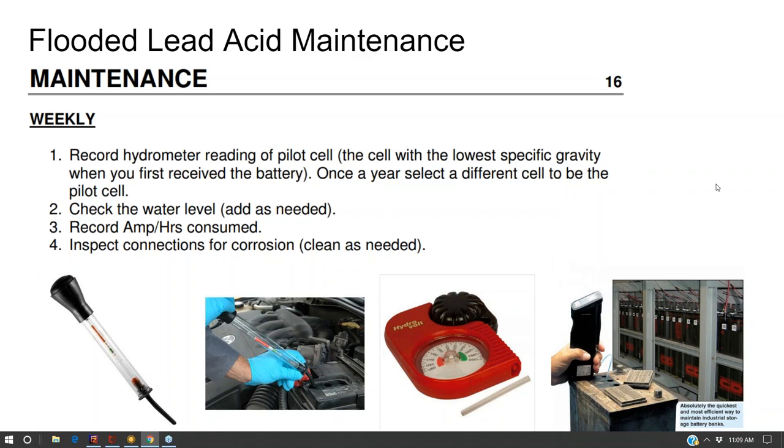The question is, what happens to stranded energy? And the answer is, it acts like open circuit voltage. The panel voltage is slightly elevated, and it just stays up in the modules as potential, like a battery that is not connected to anything. And as soon as there's a load for it, it goes in, but it doesn't hurt the system.